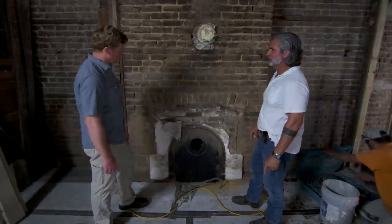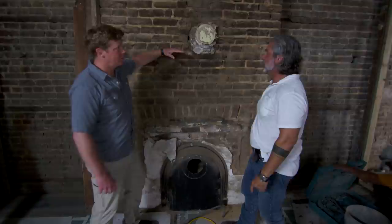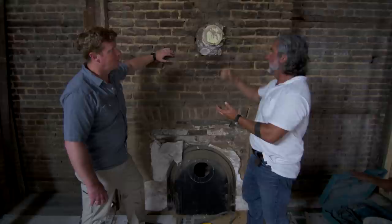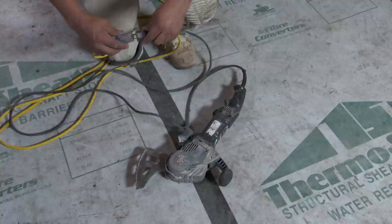What goes into that? We're going to demo out the old box, open up the smoke chamber, and rebuild this jack arch higher. So you have range, open space, and then we have to have a hood. We'll put our mechanical unit inside that'll take all the gases and fumes up the existing chimney — the blower right through there. Well, that is going to be very cool. Let's get to it.